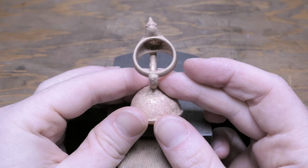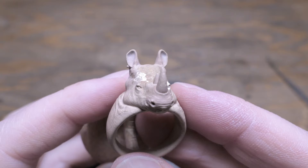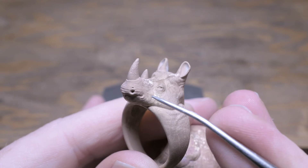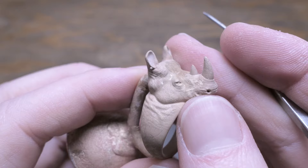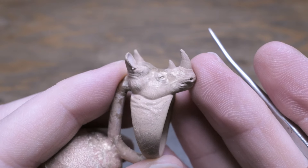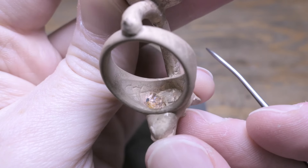After a little cleanup, here is the raw bronze casting, and I'm really happy with how this is looking so far. There's a lot of detail in the skin texture that came out really nice. There is a small defect on the nose that looks like it didn't fill in all the way — to me that looks like a small piece of investment that fell down into the mold. There's also a small defect on the ear from a bubble that was in the investment and got stuck to the print, but that should clean up pretty easily. The relief sculpt on the inside of the ring looks like it came out really nicely too.